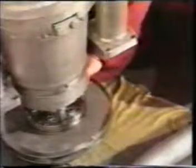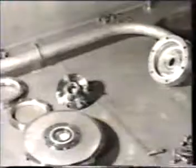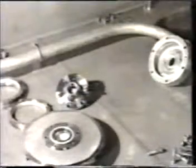Service number 3, changing of components in the hydraulic system. The service we've been demonstrating up to now, changing of wear rings and cargo seals, is the normal service on wear and tear parts done regularly on board. However, it is also possible to change all rotating parts inside the hydraulic oil chamber in the cargo pump when the pump unit is still hanging on the pipe stack in the cargo tank. Nevertheless, this service operation is needed very seldom, as all rotating parts running in clean hydraulic oil have a very long life.